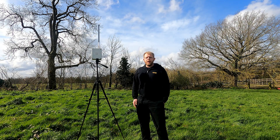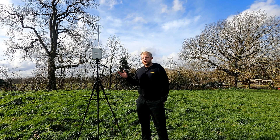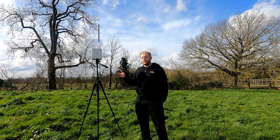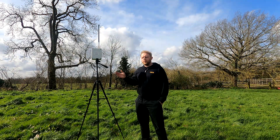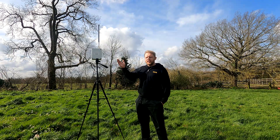What's happening YouTube, it's James G1JOB back with another Meshtastic build project. This time there isn't any solar charging system — it will just last as long as the 5x 18650 batteries will last. I designed this portable repeater to be left in a discreet location for up to a week at a time and provide a wide area of coverage depending on the antenna that's used.